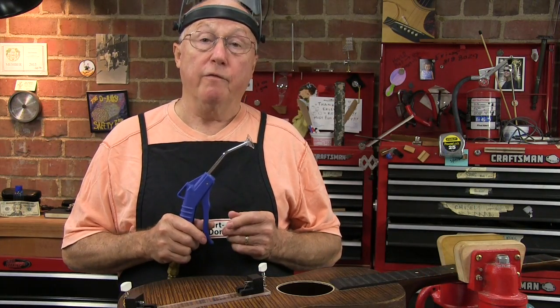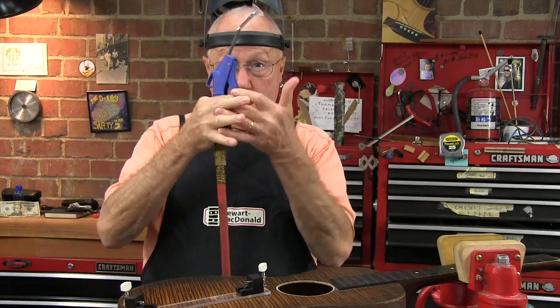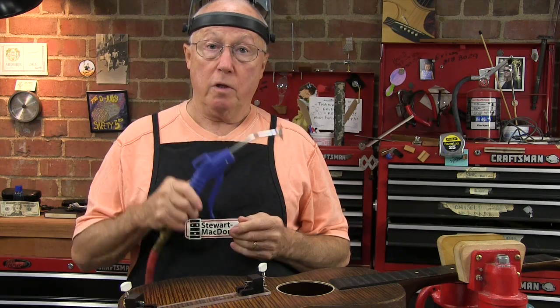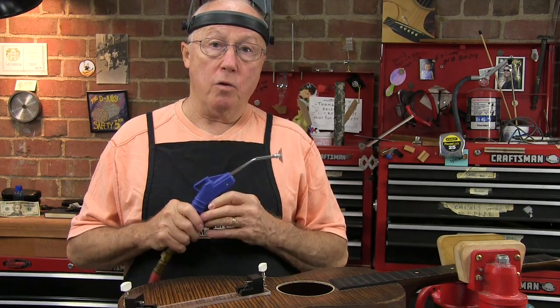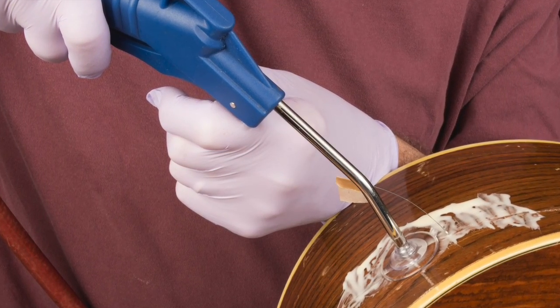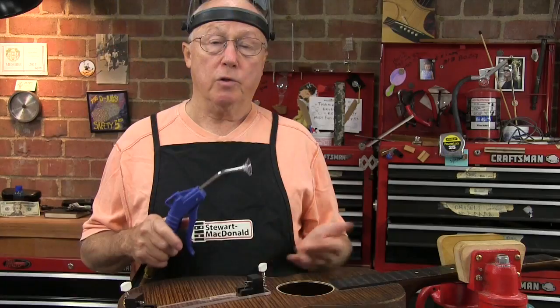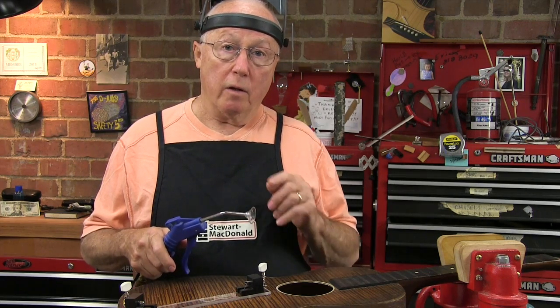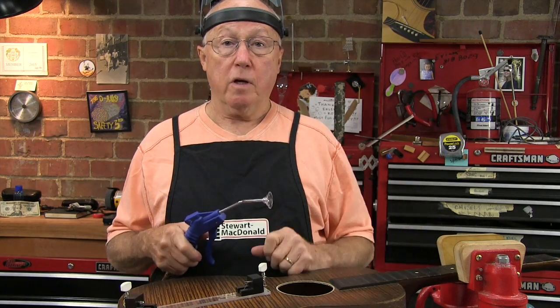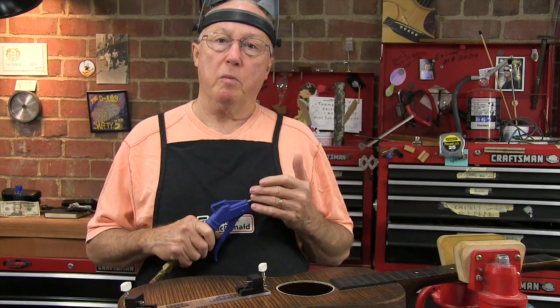There are a lot of cracks and fissured cracks where there are fractures of wood that are hard to work glue into. You can do that with the air gun — it has a suction tip and you can blow glue in at about 10 psi. My advice is if you're using Titebond or whatever glue you're using, water it down a bit on the first application so the water helps draw other glue after it. That's a tip I learned at the Martin Repair Shop.